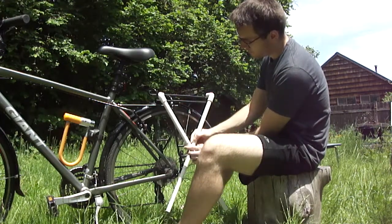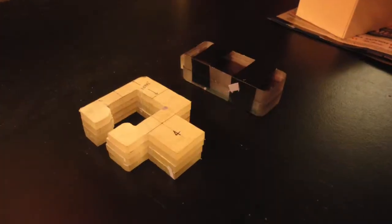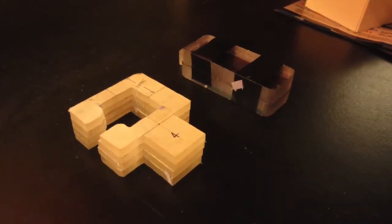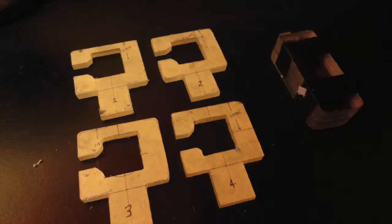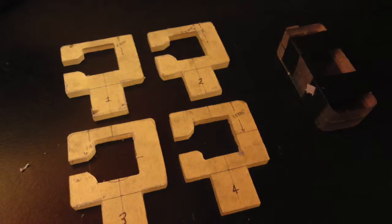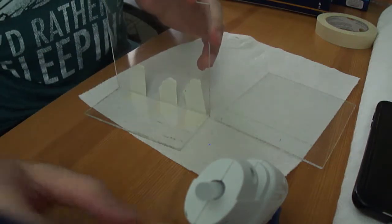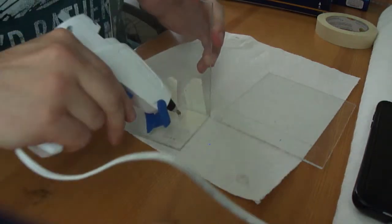The dimensions of the rack were originally designed to match the current model. The PVC pipe was cut to specification on a vertical bandsaw. The blanks for the bottom brackets and the seat post arm were also cut to specification on the vertical bandsaw. The bottom bracket was formed by joining two half-inch thick acrylic sheets together with electrical tape, and the seat post arm was formed by taping four quarter-inch thick acrylic sheets together. All acrylic sheets were salvaged from the machine shop at no cost.